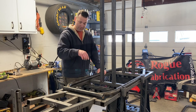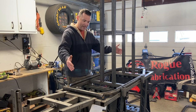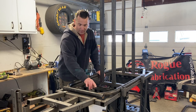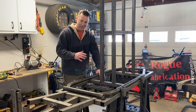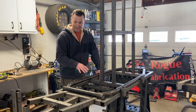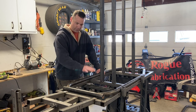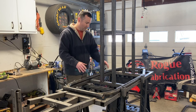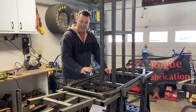You saw me flip it. When you're using a jig and you have it in the jig like that, the only way to make sure it's square is to flip it — that means the front and back aren't crooked, and the side-to-side are perfectly in line. I ended up welding these blocks onto the side instead of clamping them for that specific reason. I'm kind of a methodical guy, and that's what it takes to build these. It's not a snap-tight kit — it is a fabrication. Doing the floor first, learning how to make things square along with meticulously fitting joints, not only gives you a good base to work from, but it sets the tone and standard for the rest of the pieces.